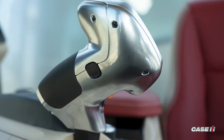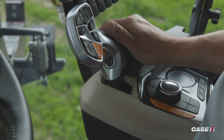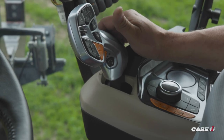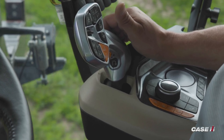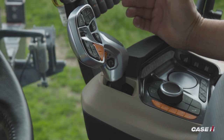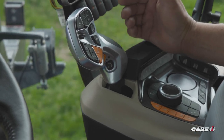I am still in a forward position at this point, so to go in a reverse direction I would have to hit the interlock button on the front of the multifunction handle. Now at that point I can pull back on the multifunction handle, reversing the machine. Because it's a return-to-neutral, letting go of the handle, it's going to maintain that backwards ground speed.